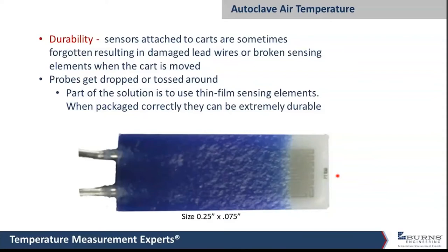Other failures seen are open circuit, typically because the probe was dropped and the sensing element wasn't designed to handle that kind of abuse. Some of the little cylindrical sensing elements are a small ceramic tube, and if you drop those on a concrete or stainless steel floor in an autoclave, they're going to crack, leading to an open circuit. Another failure mode is the guts getting pulled out of the inside of the stainless probe — because somebody forgot to untie it from the cart before wheeling it out of the autoclave. Those are the three most common failure modes.